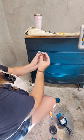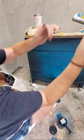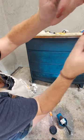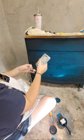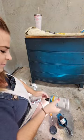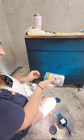So what I did is I just picture framed. I gave a 45 degree angle to the corners. Okay, so that'll match up to what's already on the body. I'm going to add a little bit of glue. This is my Tite Bond Quick and Thick adhesive.